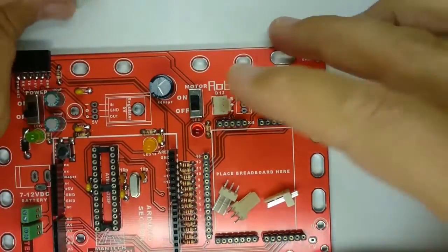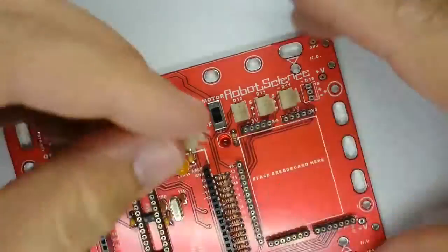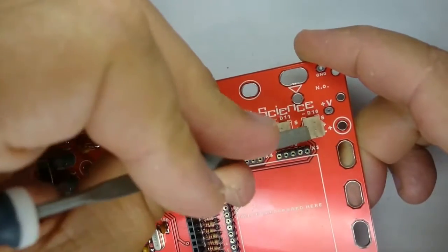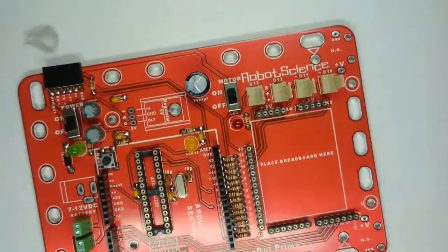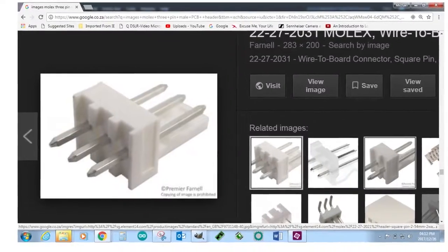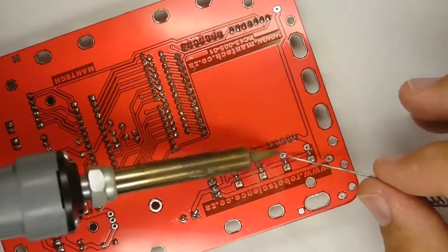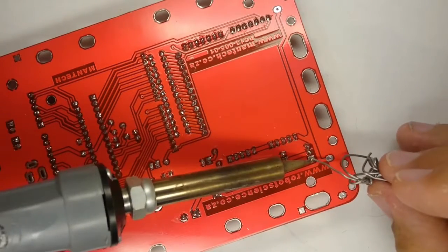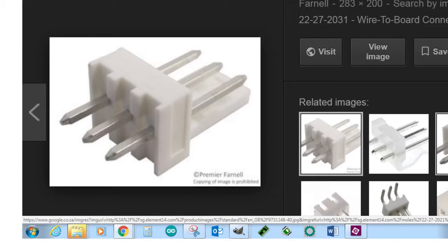There are four three-way powered male headers where you will connect devices like servo motors to your robot. Use a tiny blob of press stick to hold them from falling out when you turn the board over to solder. Make sure each part is absolutely straight and flush on the board, and that the flat tab on each powered header is oriented correctly according to the silk screen marking. Use a screwdriver to press each part down flat on the board. Solder the middle pin of each powered header first, then turn the board over and check that the body is sitting flush before soldering the two outer pins. If you solder all three pins while the part is skew, it will be very difficult to remove without damaging the board.